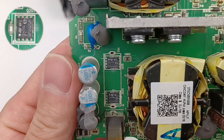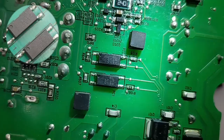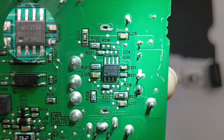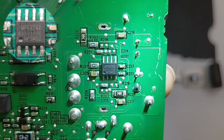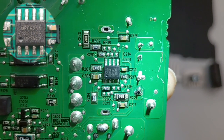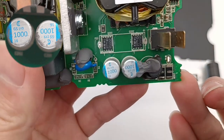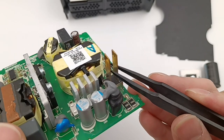These are from STMicroelectronics for LLC synchronous rectification: 60V, 2.8mΩ. Two Everlight 1019 optocouplers can protect the circuit and regulate output voltage. The synchronous rectifier controller comes from MPS MP6924A, which integrates two controllers inside. It can support an operating voltage of 4.2-35V, which can be used on 140W USB PD 3.1 power supplies. The specs of two solid capacitors are 16V 1000μF. Two current sense resistors are used for overcurrent protection. Here is the output prongs.